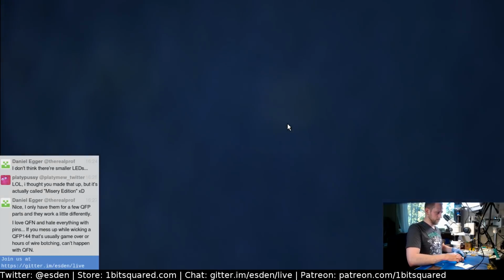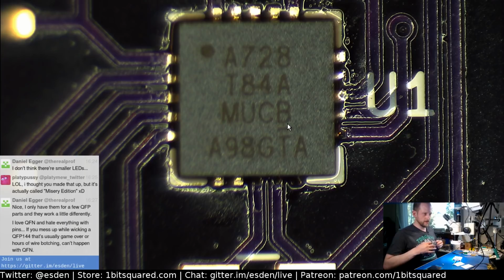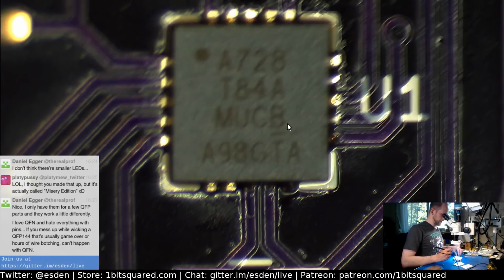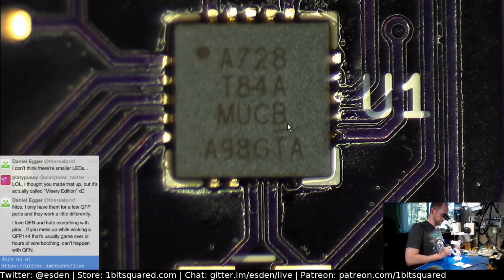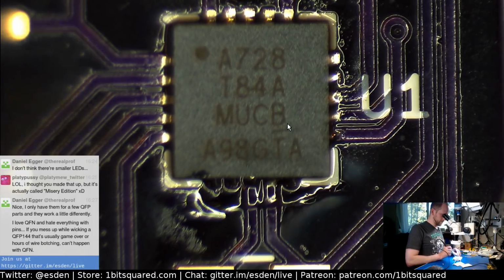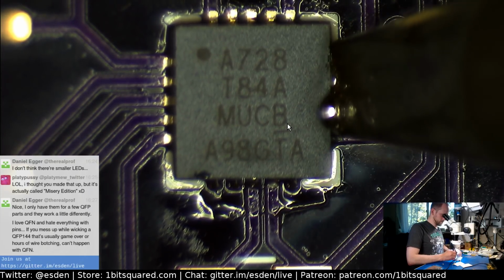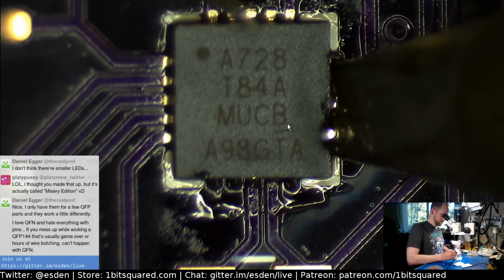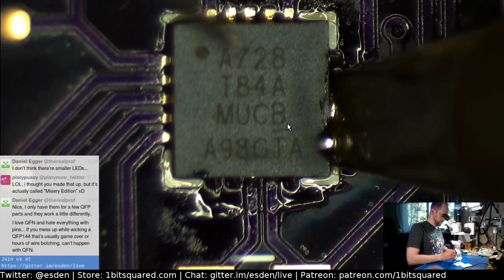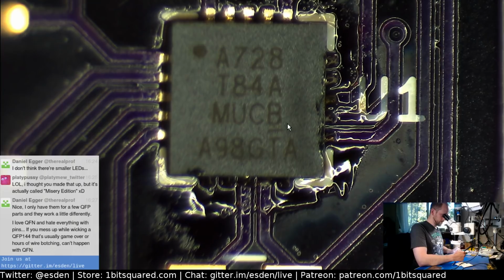So important is, so that's why one would need a... yeah, I actually do like QFNs. The biggest problem is just to add a little bit more solder here. That should work. Yeah, and you can do that with a horseshoe iron like I have here. The important thing is to keep them disconnected and keep things fluxed.